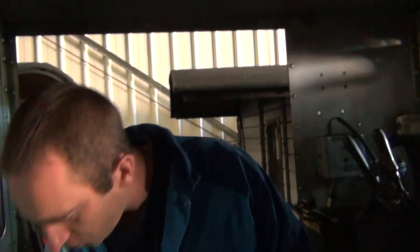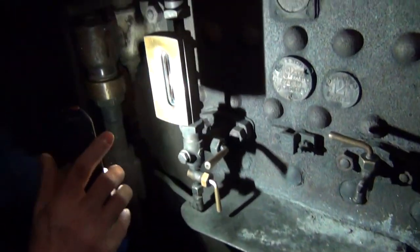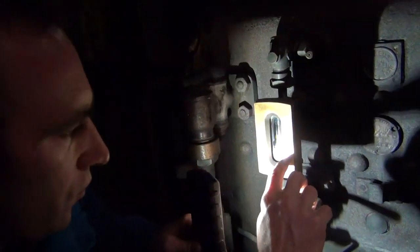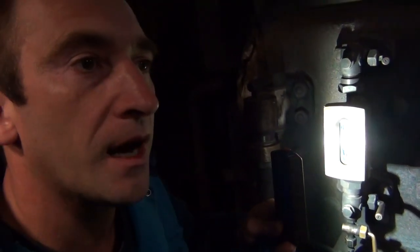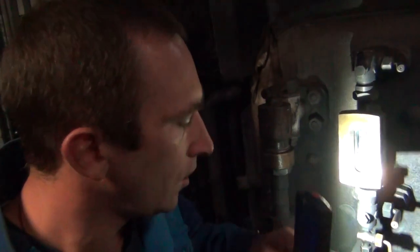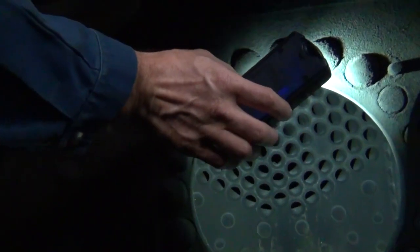We are in the cabin. I will move a few things so that our cameraman can follow me. My first verification is on the water level. On the water column, I see that the water is at minimum level, which proves there is no water leak on the loco. I am going to look at the firebox and verify that the fusible plug on the crown is not wet. It is in the middle of the firebox — it is dry. This is a sign of good health.